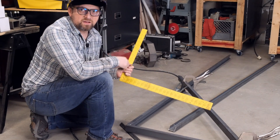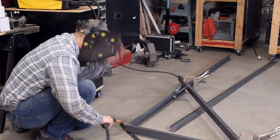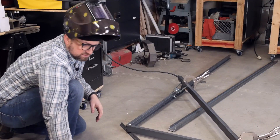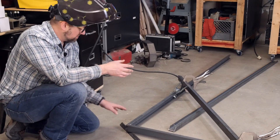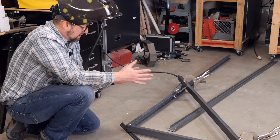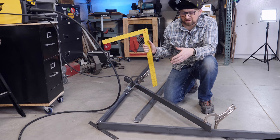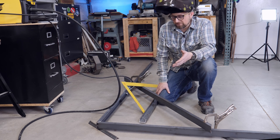At this point I'm going to tack the front edge on the top and the bottom, then check it for square again. With two tacks in the front corner, you're basically making a hinge, so by tacking this outside edge you should be able to move it just a little bit in and out. This works great as long as you're patient and use your square a lot — these things can move around a little bit.